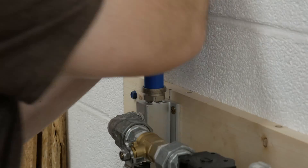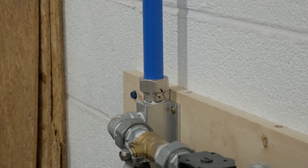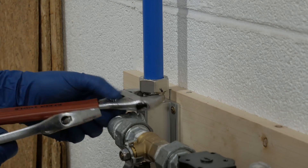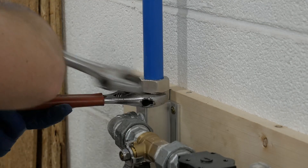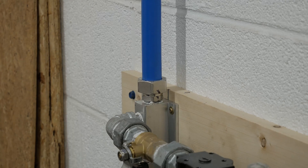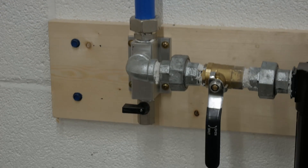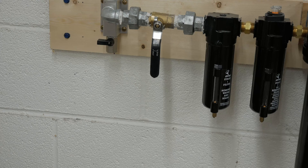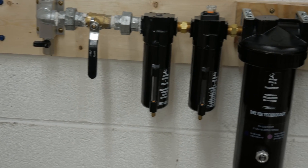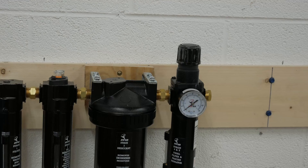This is the first drop. All you do is cut it with the supplied cutters, use the deburring tool, and chamfer both ends with it — it does it in one setting. Then mark the compression fitting nut and a guide mark on the actual fitting itself. Make sure you get at least a three-quarter revolution around the nut to make sure it's tight. Most of mine went to a full revolution, and there's nothing wrong with that. They have you mark them to ensure you're getting that required revolution. Once I marked one or two, I didn't find it necessary to do it again — you kind of get a feel for it right from the beginning.